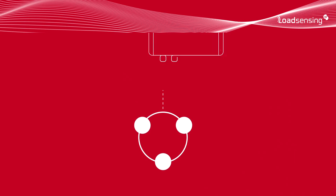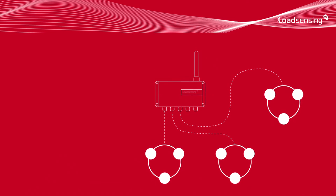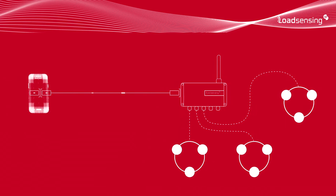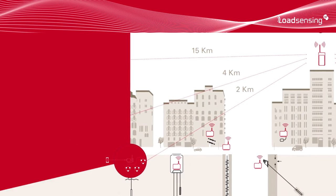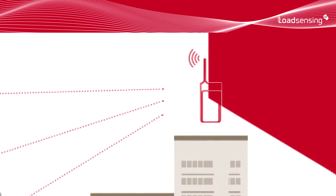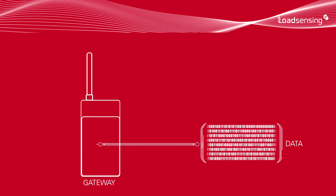The system architecture is as follows. The sensors are installed and connected to the data loggers. Each data logger may be connected to one or more sensors depending on the models. The data loggers are easily configured on the field using a smartphone app. The data loggers send their readings over the long-range radio link to a gateway. The gateway is responsible for receiving, processing and storing the data from the sensors. Up to a thousand data loggers can send data to the same gateway.